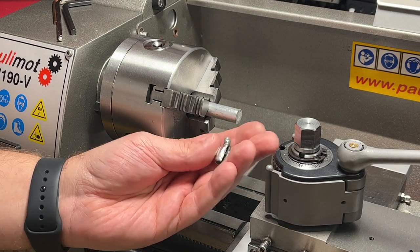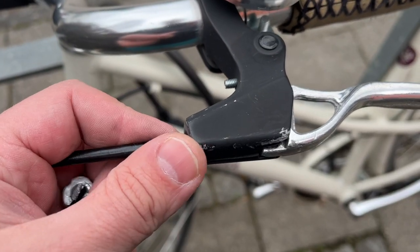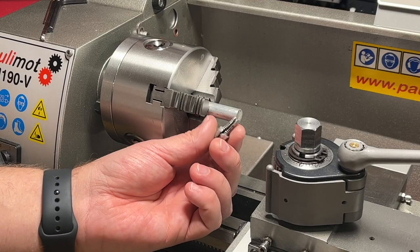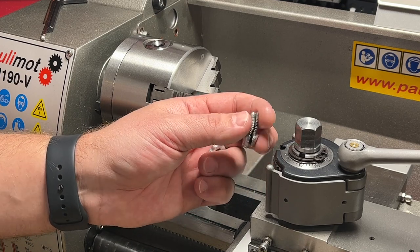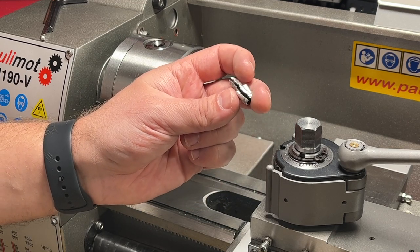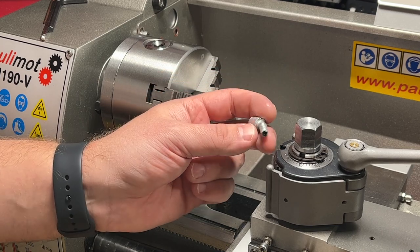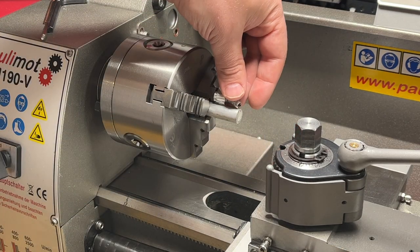In this video I want to make these tuning screws for bicycle brake levers. For me these are interesting projects because here I have the place for the brake cable. Also, there is a 7 mm thread with 1 mm pitch that is also not a standard thread, so I will need to make threading on the lathe. Yeah, that could be quite interesting.